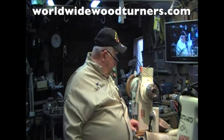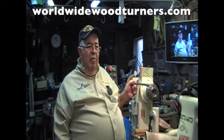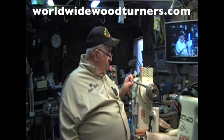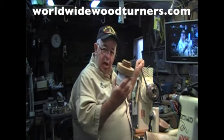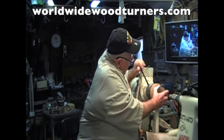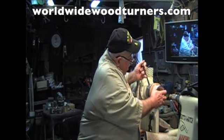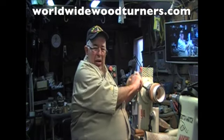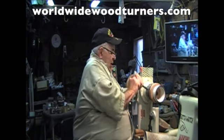This is my one-way Stronghold chuck. It could be a Vicmarc. It could be a Barracuda. It's a chuck, all right? And I don't really need a chuck, but I'm putting it in a chuck. This is it, and I have a little dovetail glued on the back of this block. And this block is as simple as can be. I have the tenon to the right size using my tenon jig because I don't want to be under-grabbing or over-grabbing. So I'm going to put that in there and snug it up a little bit. And for right now, I'm not allowed to turn the machine on. It's the freaking rules. So I'm going to tighten it up.